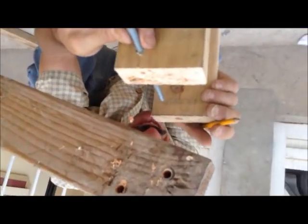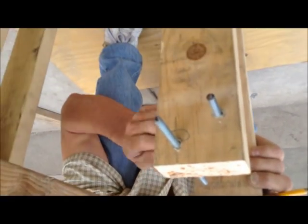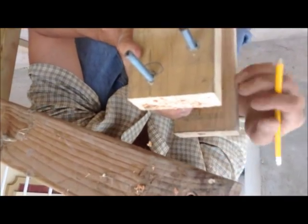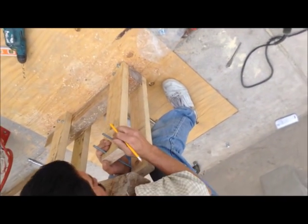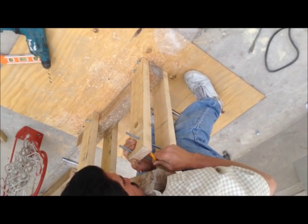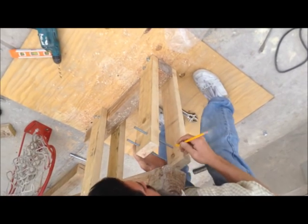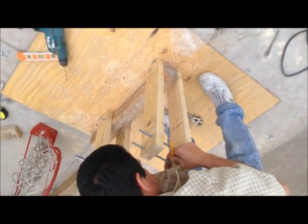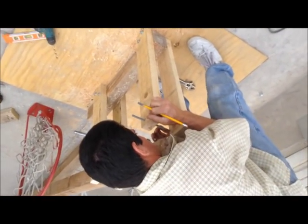All right, so what do you know? Stop that learning, baby. You did it wrong. You went up instead of straight. All right, I went up. We can always make it with the drill bit a little bit, you know, give it more play with the drill bit if it's not accurate. It doesn't have to be exact. If you move your drill bit around when you're drilling the holes, it makes the hole a little bit bigger, so you have more play in case you missed it by an eighth or so.